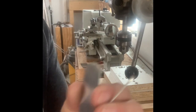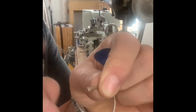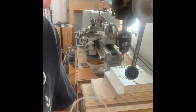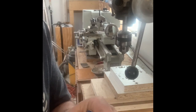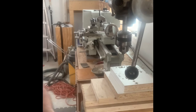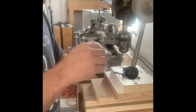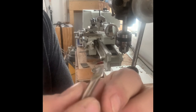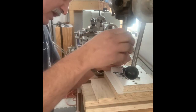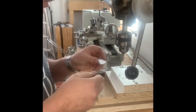Since we started incorporating these lanyards, they kind of go around inside the hole like this. You have to drill a big enough hole so the lanyard fits through. We use a specialty bit — it has a super point to it and it also takes off any burrs on top. So it's kind of like two bits in one. It's a centering bit, so I don't have to put a punch mark on the reed balancer.